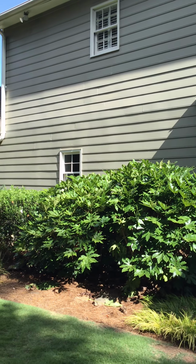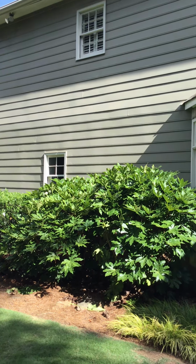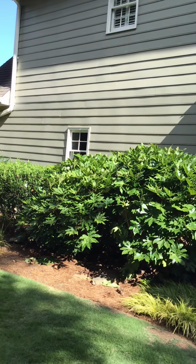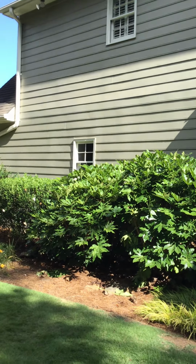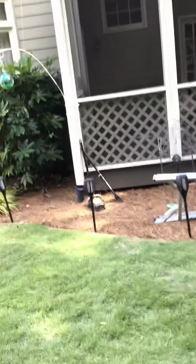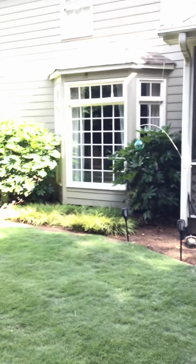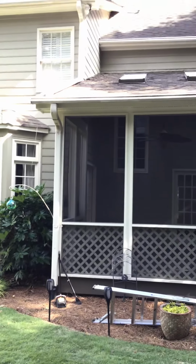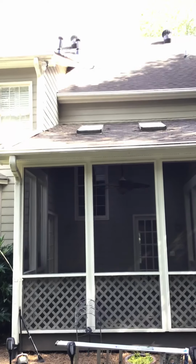If you look at the row of Masonite siding above that last row, right here, this is Hardie and this next row is Masonite. See how there's no imperfections in that board all the way across? If you hire contractors who know what they're doing, it's really going to go a long way. We've seen so many jobs where, with Masonite siding, the customer's told that they need to replace all of it, or a contractor comes out and gives them a cheap price, and before you know it, they're ripping off one board at a time and they're up the whole side of the house because they don't know what they're doing.